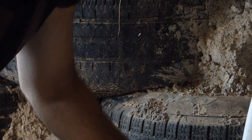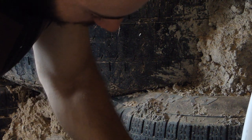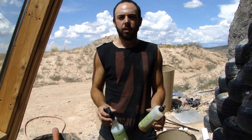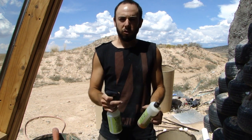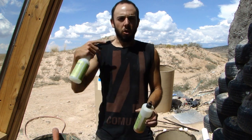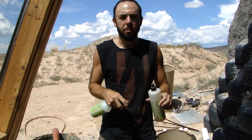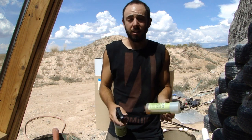Let's see if the system will hold pressure. I can hear it leaking out somewhere — getting a little bit of pressure but it's leaking. To check for leaks, we need mild dish soap mixed with water and we're going to spray it on all the joints of the plumbing, all the PEX crimp joints, and look for where we see bubbles coming out of the connections — that's going to signify where there's a leak.